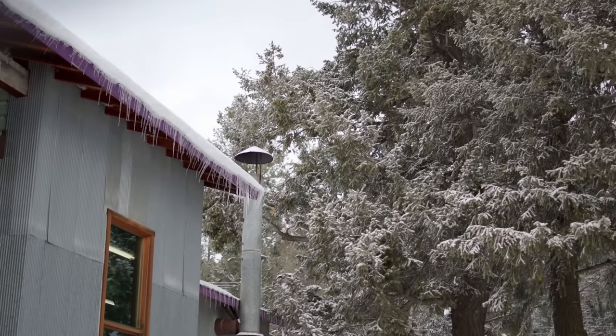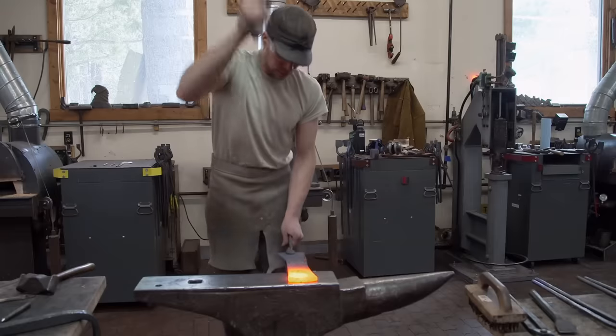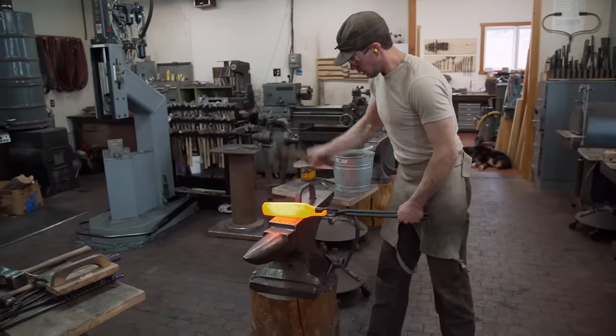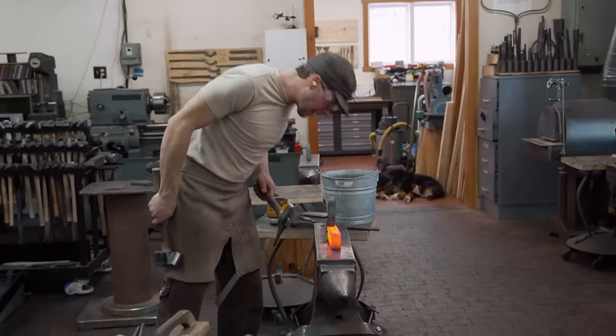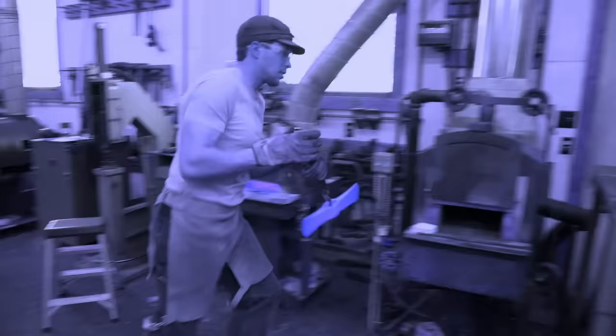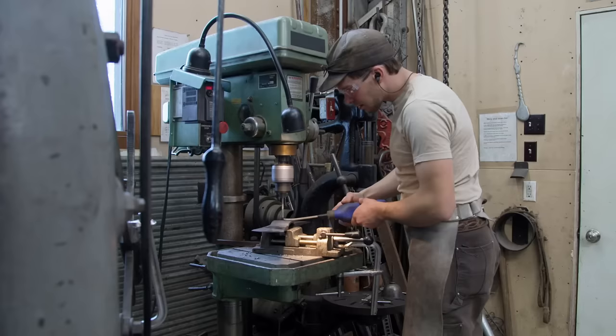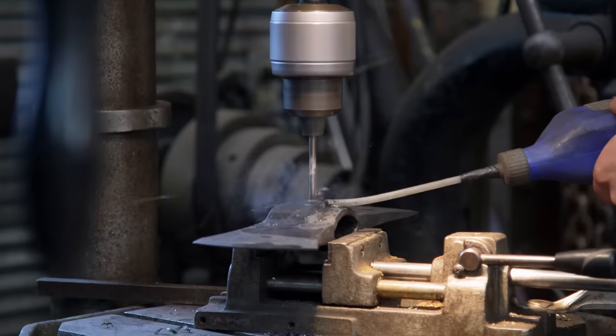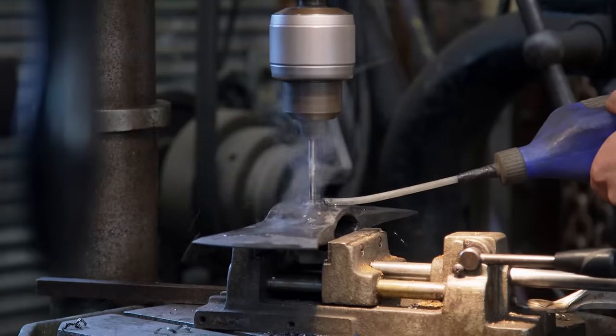Probably the biggest tool I've made is an eight-pound sledgehammer, but I've never made an axe of this size. Now that I've forged this billet, I want to punch this eye by hand to make sure I don't make a mistake. I just got into the parameters yesterday in my forging and quenching. The next thing is to drill a single hole for my axe eye. Later we'll have a pin to mechanically hold the handle to the axe as an extra safety precaution.